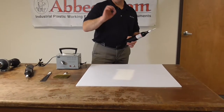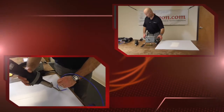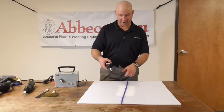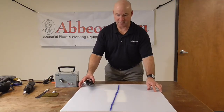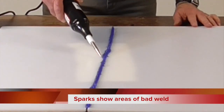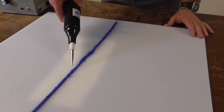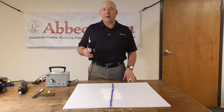Okay, so now we're going to go ahead and do a weld and then we'll test it again — hopefully there's no spark. We've got our BD-10AS spark tester and we're going to run along the line. We still have our aluminum foil underneath the piece there as our conductor. Okay, so we have now tested it and we're good to go.